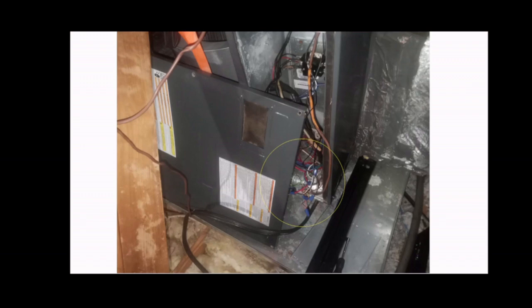It could be a broken wire. It could also be a short in the wiring, meaning that there is some exposed metal or copper of a wire that is touching either another wire or the frame, shorting out the wire and the electrical system of the unit. It could be several things, including the ones I just mentioned. It could also be a motor. As you can see, the motor is seen there. The blower motor, that's just burnt, disconnected, faulty, broken.